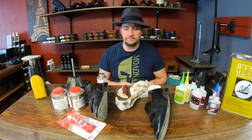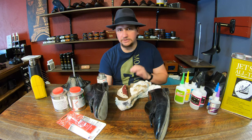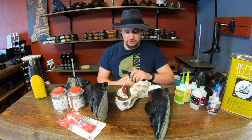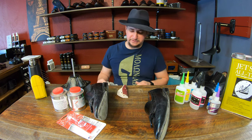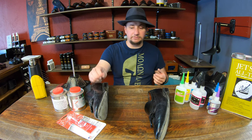You're gonna leave it open so that the adhesive's kind of not dry, but it allows the turpentines or acetones to evaporate, because the solvents aren't gonna let it adhere properly. It's just gonna kind of deactivate itself again. So you're not gonna be able to glue it immediately.